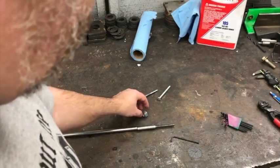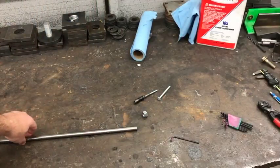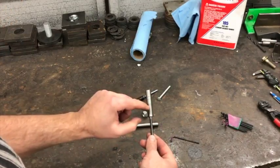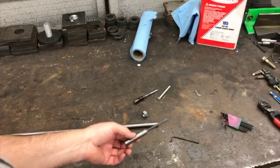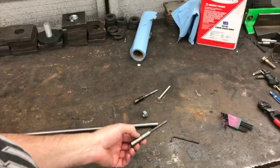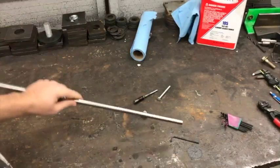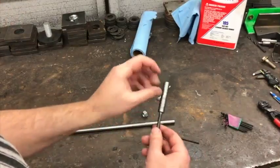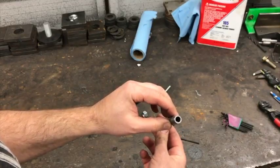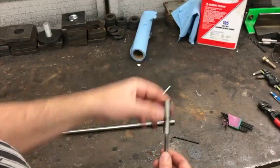And the other thing that he wants is this has got to have a cord. This goes to some kind of antique chandelier, and he wants a lamp cord to be able to come down in this and exit out. So this is the part that I wasn't originally going to do, but since I'm making this, I thought, well, what the heck. He was talking about drilling a hole in the threads on this end himself. And I've got a mill. I can throw this in there and mill a little slot in it. The internal diameter, this is 3/8. I could mill a 3/8 inch slot so he can get the cord out.